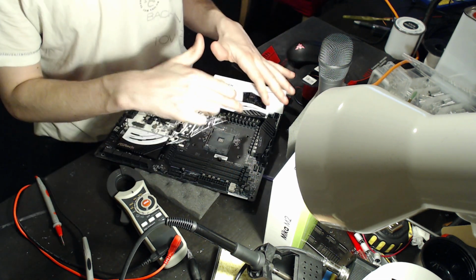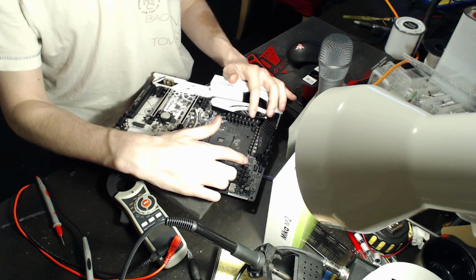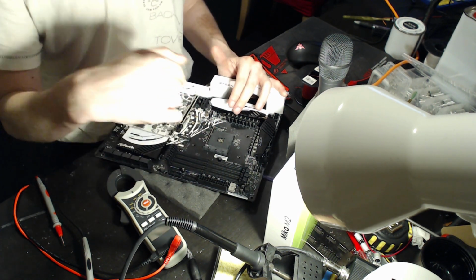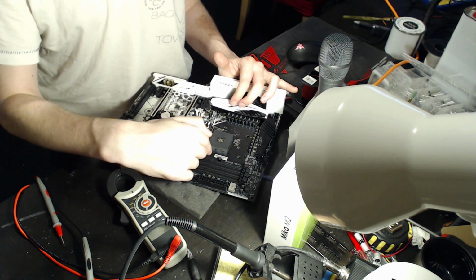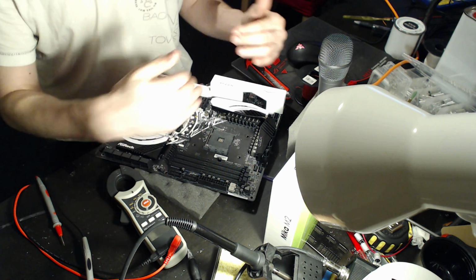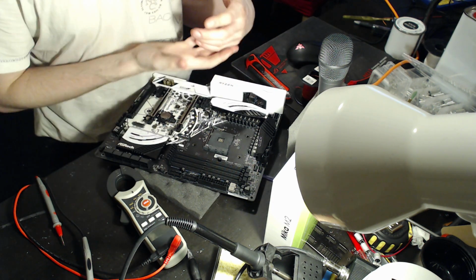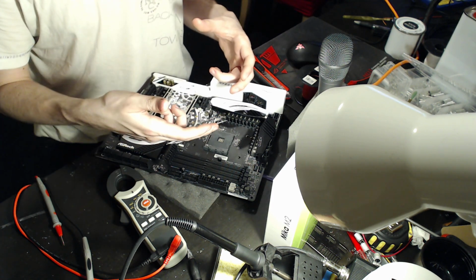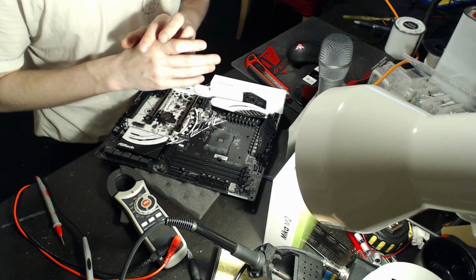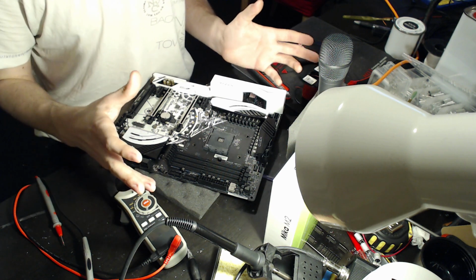So you can't measure voltage off of the VRM, because if you have LLC enabled, what the voltage controller actually sees is the voltage as close to the CPU as possible. In fact, there's a pin on CPU sockets which is used by voltage controllers to read CPU voltage basically off of the CPU package itself, which would be ideal. Unfortunately, for Ryzen, that would mean delidding the CPU and trying to solder onto the capacitors around the CPU, which would be incredibly hard to do, with a very high probability of you killing the CPU.